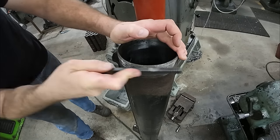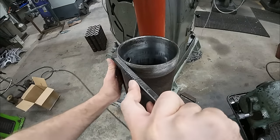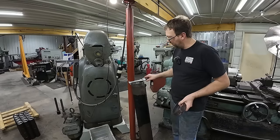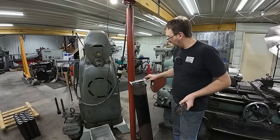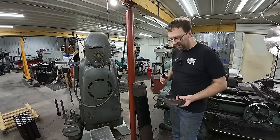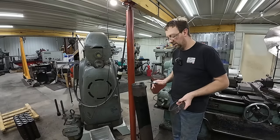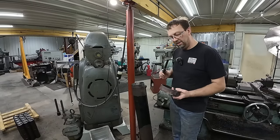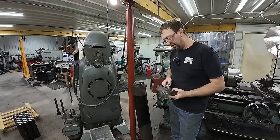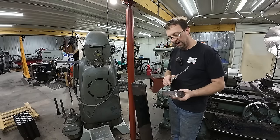There, you can probably hear it. All right, so I just got done measuring up my barrel here. I'm at 5.5 inch for thread, 5.5-12, and the Machinery's Handbook doesn't go big enough to do 5.5-12, but I calculated out what I need, and then I measured the diameter on the inside of this nut, and it has shrunk over 50 thousandths by cutting it.